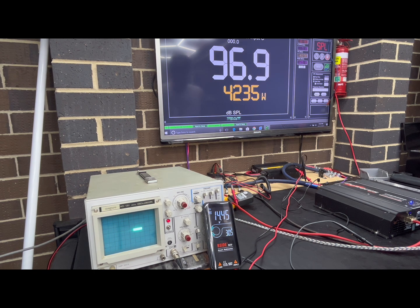That's definitely a decent amount of current. Even though it only has 4 gauge inputs, I would have honestly put 0 gauge. But because of the size of the amp, it's not too bad. Even with those quick bursts, the fans are only switching on and off, so you're not having to listen to that horrible sound. But onto the gut shots.